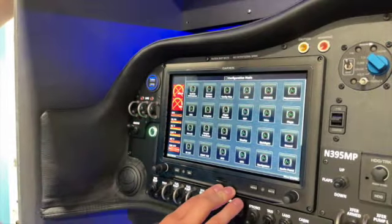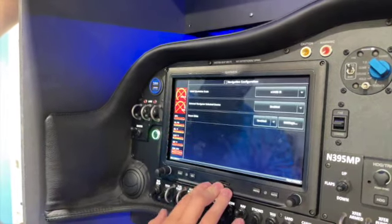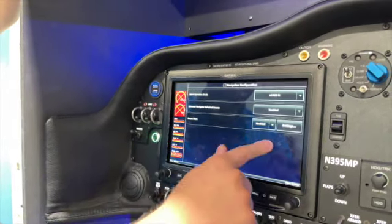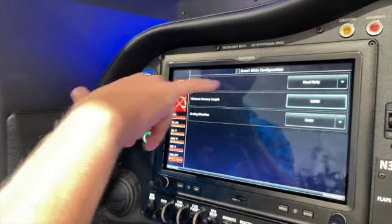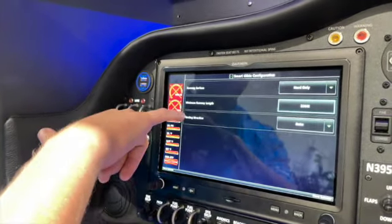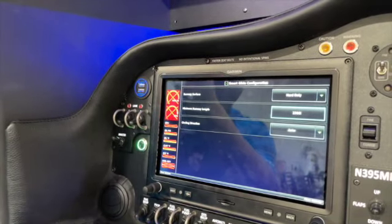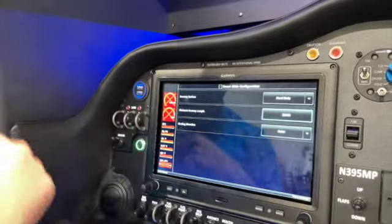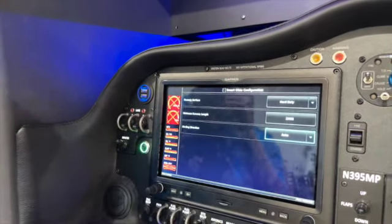Okay so we're here in config mode. If we go down to the navigation configuration page we get the new option for Smart Glide. So of course we have it enabled. Under settings, this is the runway criteria that it tries to follow: hard-only runways, 2300-foot minimum runway length, and then the circling direction. You saw at the very end of our demonstration where it started to turn left — you can force it to go left, go right, or auto depending on the context of whatever it's doing.